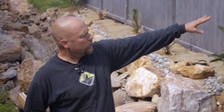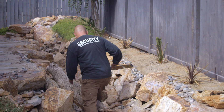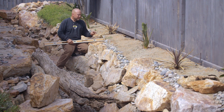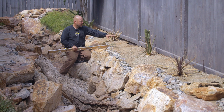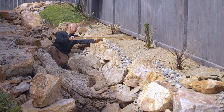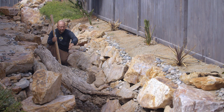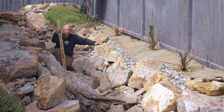Pay close attention to this edge where the fence meets the pond — I'm going to show you how everything's pitched into the pond. Here's a spot on the fence line where the dirt is approximately one inch too tall, and over there it's probably four inches too tall. The contractor left too much dirt here, jeopardizing the fence. This whole side is pitched into the pond, so every time there's irrigation or rainwater runoff, it comes right in, makes the pond dirty, and makes it hard to maintain. We want all the water to shed away from the pond.